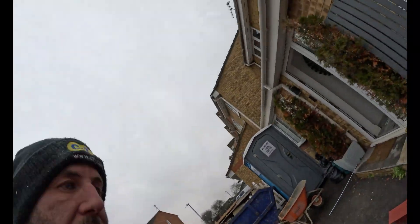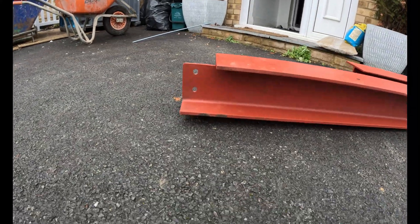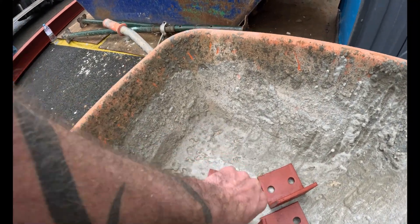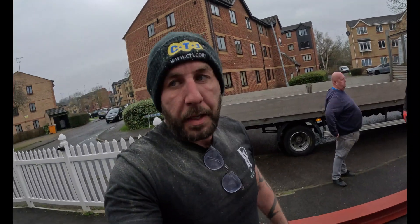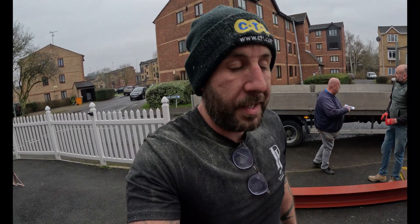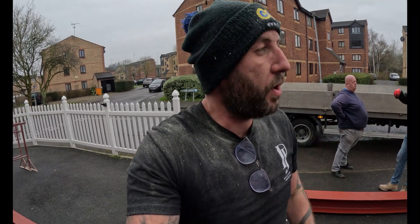Steels are here — nice and heavy. We've got the two smaller ones, ready to go. Couple of holes in. We've got our cleats — that's going to be our connection detail. And then we've got the main long one. So that's probably us for today. We're going to pick up the timbers in the morning, bring the little access dolly trolley in, drill the holes in, get the timber blocking done nice and tight, and then we'll start installing them.